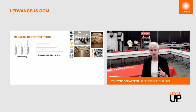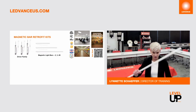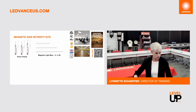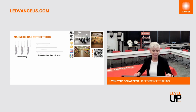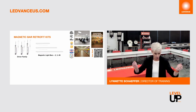So the way that this works is that if you need to get DLC Premium and you're using them as a linear ambient or low bay category, this does require the removal of the lens. So that means you would actually have to take the lens off from the LED bar. The way that you do this is, first of all, you have to remove this end cap. It just simply pops off. And then once you get that removed, you can get your finger underneath here, and then you just basically pull it apart.